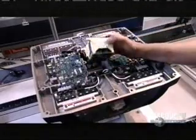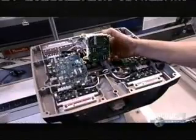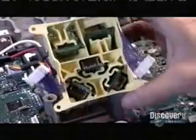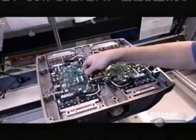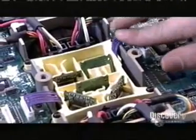Then she adds what's called the balance sensor assembly. This includes 5 gyroscopes and 2 components called fluid tilt sensors. These instruments gauge the vehicle's position relative to the ground. The controller boards check these instruments 100 times per second and adjust the vehicle by rolling the wheels forward or backward when the rider leans either way.